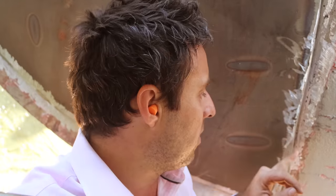What was happening, I think my settings were wrong because I was getting a lot of undercut. I was also getting a really heaped up weld profile. Starting to look garbage, and I just knew it wasn't going to be a good weld. So I've just cut it all out, and I'll start again and reset the machine. I'll probably get a bit of scrap and start mucking around with it and figure out what's going on. And then once that's dialed in, then I'll start welding the plate.